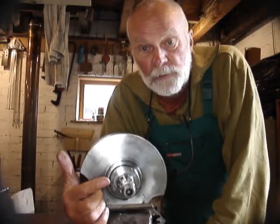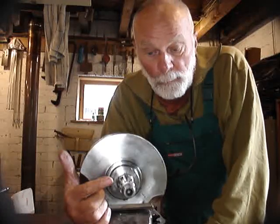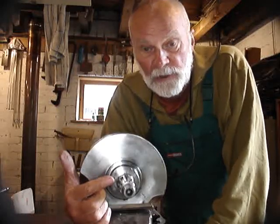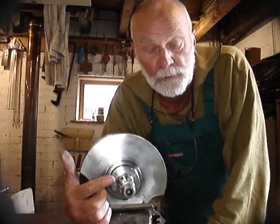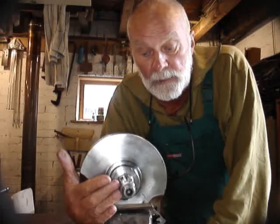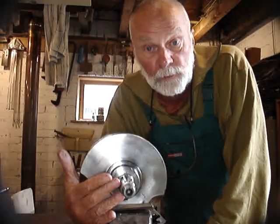Splines are normally used in gearboxes and are a loose sliding fit, so all you have to do when gauging them through the inspection department in the factory is to make sure that the shaft is not too big and the hub is not too small.